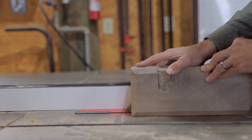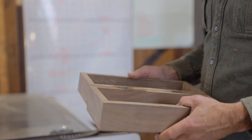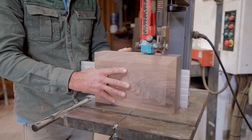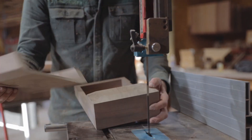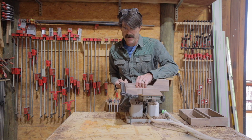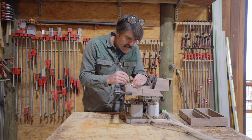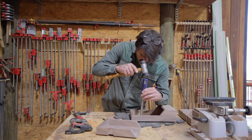Here's an opportunity to take this box making process in a direction that suits your own ideas or creativity. There's nothing saying that you have to cut this straight — feel free to take this to the chop saw, put an angle on it, or even the band saw. The domino really comes in handy at this point for creating the slot for the leather strap. Now comes the fun part of mortising in the hinge. I'm going to clamp these two pieces together to get that perfect alignment, mark it out, and then use a chisel to make way for that hinge.